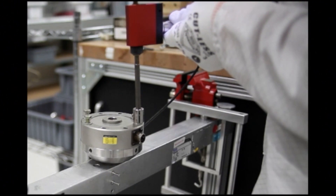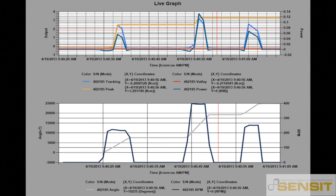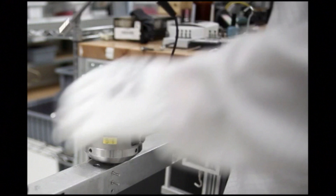Additionally, both USB devices have the ability to work with encoders such as those in our TRS605 rotary torque sensors that can be used to measure RPM and angle. Both offer quadrature readings up to 150,000 pulses per second for speed and up to 10,000 pulses per rotation for angle measurements.